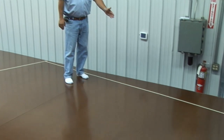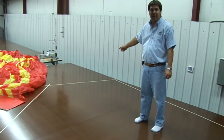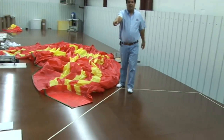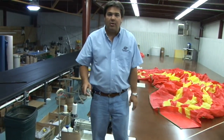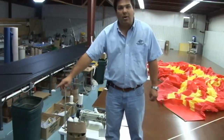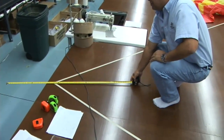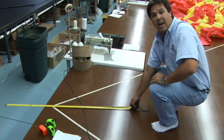For this edge we'll make it entirely straight. The other three edges are going to be free — no support except for the fact that there will be a post at this corner and a post at the far corner. When we figure the size of the awning or the placement of the posts, we want to make sure that the stress line — or what I'll call the sheath position — is roughly bisecting the corner. So our post position will want to extend off of this line roughly.